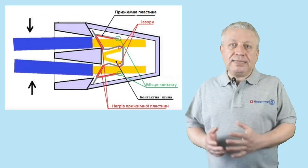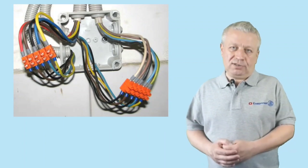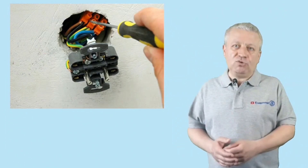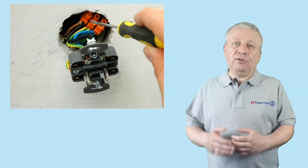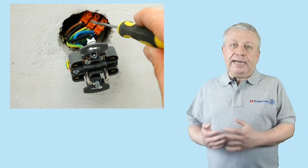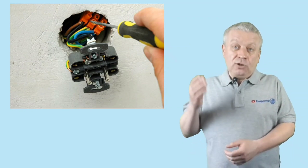The terminal block method has one significant disadvantage: most pads sold are of very low quality. Some electricians, to avoid direct contact between copper and aluminum, solder the copper core and do not insert it inside — however, the terminal must be disassembled for this. In addition, reliable contact of aluminum under a screw without revision does not last very long — screws need to be tightened every 6 months to a year. The frequency depends on load fluctuations. If this connection is hidden deep in the wall socket, climbing in every time is not convenient.